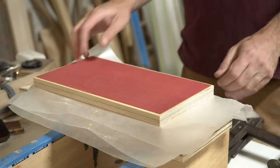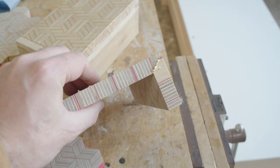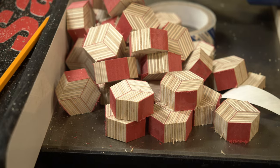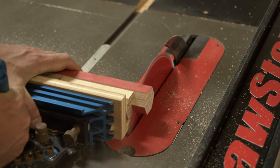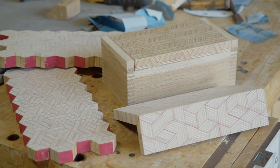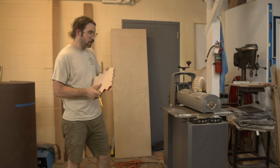This is me beginning the process of making the pattern plywood top, or the lid. I wanted it to have this waterfall edge, which just means the pattern will be continuous from the top of the box then falling down to the front side. I ended up making like 7,000 little cutoffs to do a bunch of different glue-ups and prototype the exact shape and size of the lid. I made a bunch of different pattern plywood blanks and brought them over to my buddy Brian's shop. Brian has this nifty little drum sander that I was able to use to get each blank nice and flat.